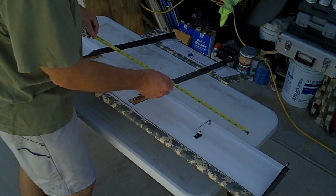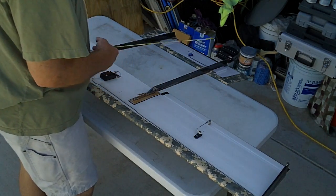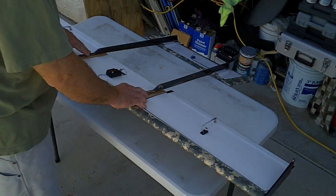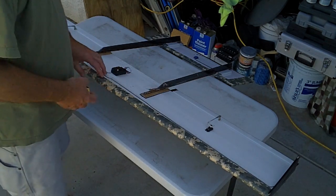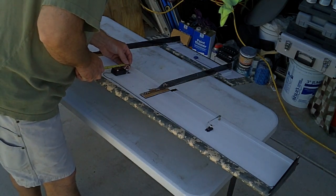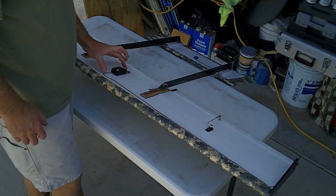So the control surfaces on the wing are 22.5 by the 1 3/4 that I mentioned earlier. The boom locations are again 14 inches on center. So this wing has within it two dowels. I used a 1/2 inch dowel inside here. So there's 2 of them.